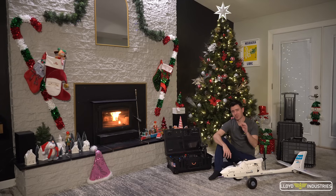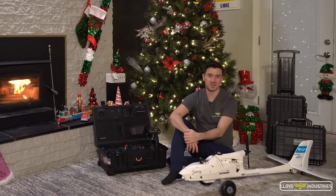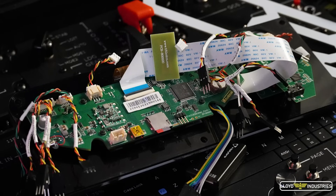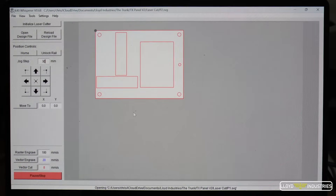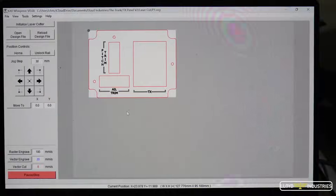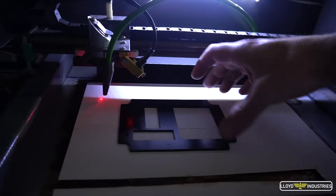All the pillars have threaded inserts that the panels bolt down to. This design allows for easy customization, giving you a wide range of options to choose from for your panels. I've already gone through three different iterations of the transmitter panel, including taking apart an old Taranis radio, so I'm glad I made it versatile. For the panels themselves, I exported the sketches from CAD and laser cut some 3mm acrylic sheets. I spray painted them black and stuck them back in the laser to engrave the lettering.